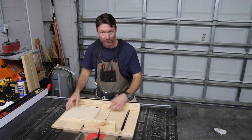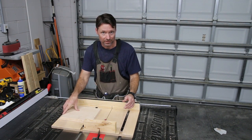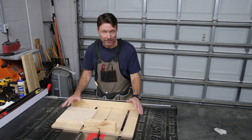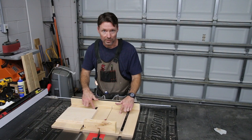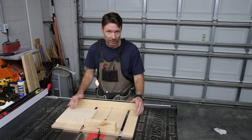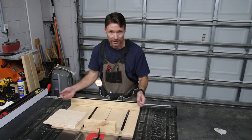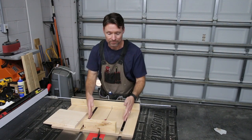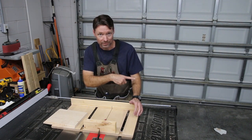I didn't go super tall on the fence here because pretty much everything I work with is three-quarter inch, so if I ever have to cross-cut something that's taller than this fence, there's plenty of other ways to do that. I love the size of it — it keeps the weight down. I didn't want a really big, heavy sled, so I purposefully made this one smaller than my last one. This is my first sled with T-track in it, so I'm really excited to get to know that process. Another thing I like is I put these T-tracks right over the runners, which makes it really easy to line this guy up — I can almost perfectly drop it right on the saw because I know right where those runners are. I hope you enjoyed this video. Be sure to like and subscribe, and check out these other awesome videos right here.